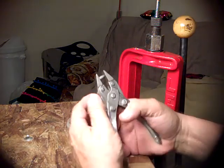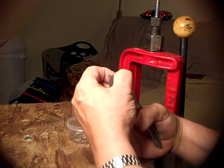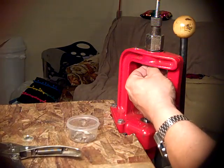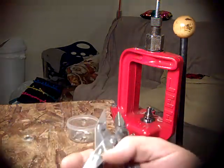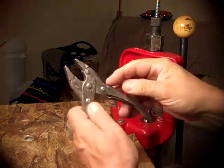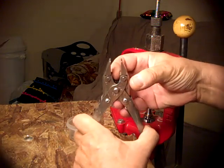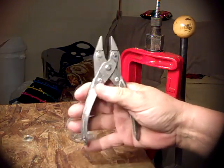Now, the way it's set up right now, one of the problems I have is they don't stick in the thing. So I have these pliers, which say Model E9E. These were specialty square jaw pliers that I bought off of eBay. As most of you probably know, square jaw pliers being in huge demand are very expensive right now. So I bought these, which only opened that far when I first bought them. I had to take them apart and grind out the bases of the jaws with longer slots so they'd open farther. And then I ground this stop area in here a little bit.